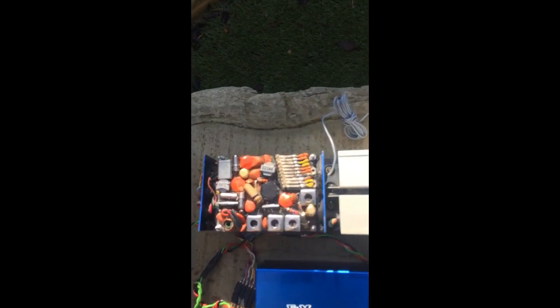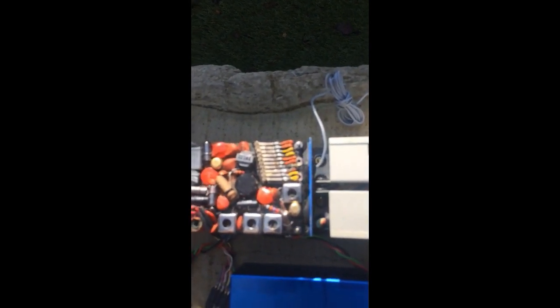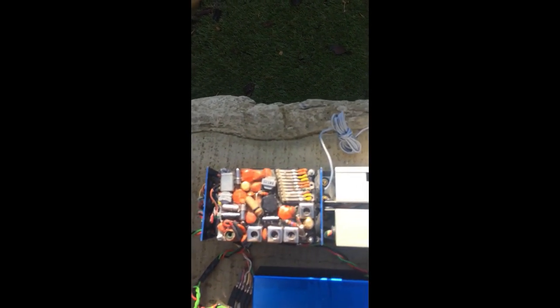If I zoom in to the receiver, you can see the reed relay bank at the top right. As I mentioned before, it's ten channels, although there's five spring toggle switches which control two channels each, and you have to tune each one of these in. I'm now going to operate the transmitter and you can hear the tones — you won't be able to see the reed relays move. These needed tuning regularly, which I remember very well helping my dad many years ago.